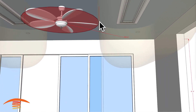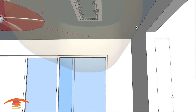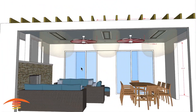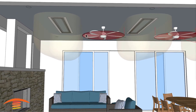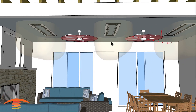I met that clearance there. And looking at the wall, I want to make sure I meet that 18 inches of clearance, which should not be an issue. These heaters are in the center of the patio structure itself. Looking over here, we're not hitting the TV or the fan on this side. But again, this side is an issue, so either this unit would have to be eliminated or you'd have to change these fans out.